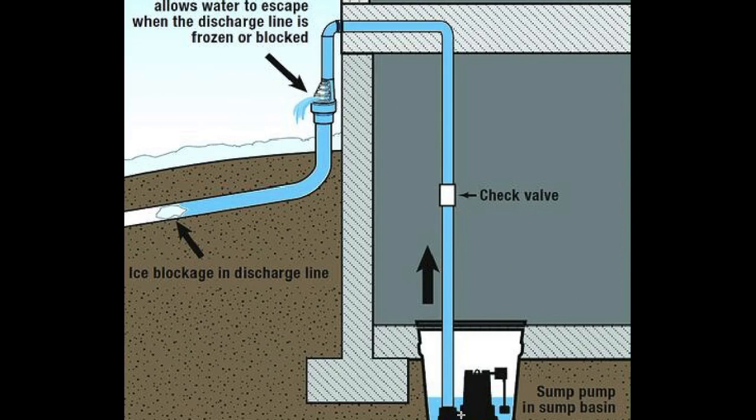Let's go all the way down to the sump pump chamber, or basin, as you see right here — and there is the sump pump. There's the pipe that feeds out of the sump pump. The blue, obviously, is the water. There's the float right there. As the water enters the chamber and fills up, raising that float, it's going to activate the sump pump, which is going to pump the water upstream per the arrow. And there is your check valve, continuing all the way up to the top portion of the ceiling, making a 90-degree angle turn, and exiting the home.